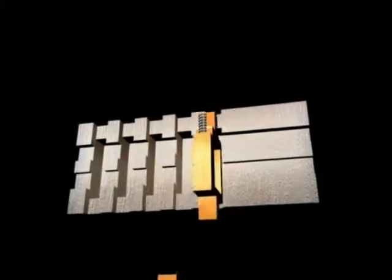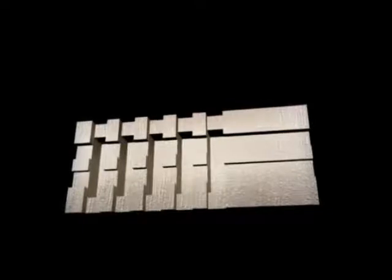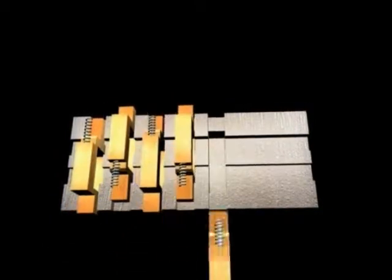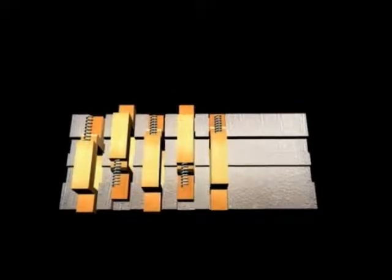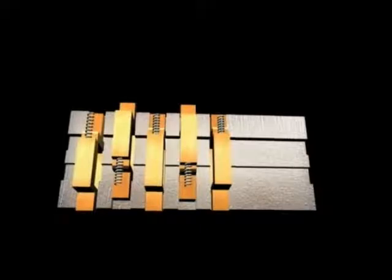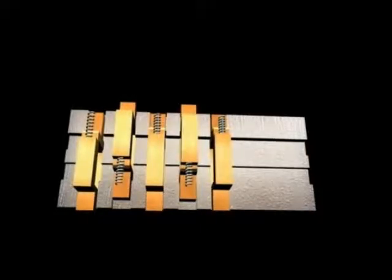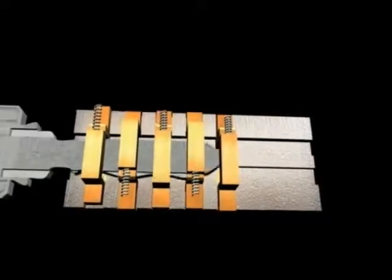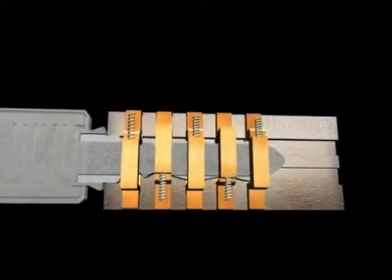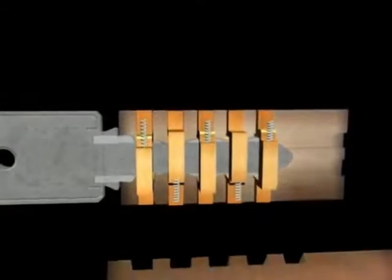In an attempt to increase their security, manufacturers have developed the double-sided wafer lock. The wafers have alternating springs, so some will have to be pushed up, while others need to be pushed down. Their keys are quite distinguishable because they have notches on both sides and may be inserted in either direction. Here is where your set of double-sided picks will come in handy.